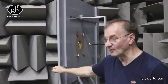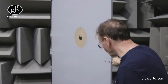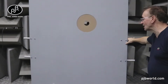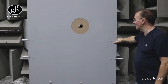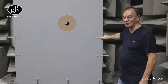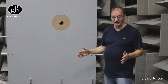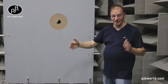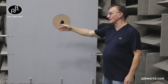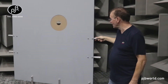This is a standard we call an IEC baffle, and this is where we do loudspeaker drive unit analysis — examining the loudspeaker out of its enclosure and how it behaves on its own. We want to see how the speaker works without the effect of the enclosure, since the enclosure affects the loudspeaker radiation pattern due to its geometry and size. This is done with a close mic at about one meter, and we can also do on-axis and off-axis measurements with this setup.